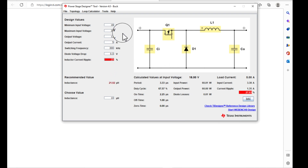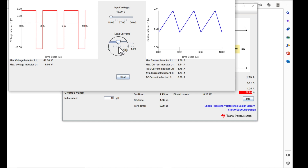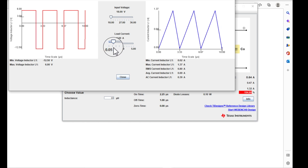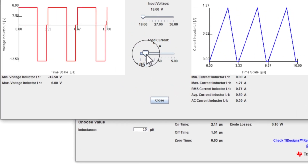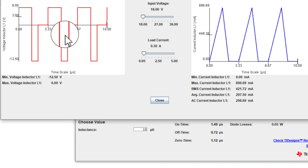Once you're set up, you can say I want to see what's going through my inductor — just click on it. That's the current going to the inductor. This is the low input, 18 volts and 5 amps max. But what if my current drops to half or all the way down? Right there it's going to become discontinuous, at about 0.7 amps. If you don't want it to become discontinuous, you can use that larger inductor so you can go down to lower current. It's really cool because it can show you those things without doing all the math. Now I'm discontinuous — I have some dead time over here on the left. You can see the on, off, and then some dead time.